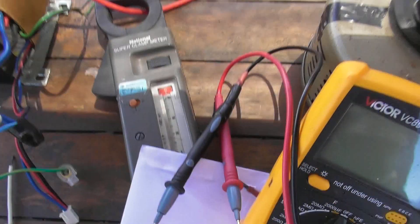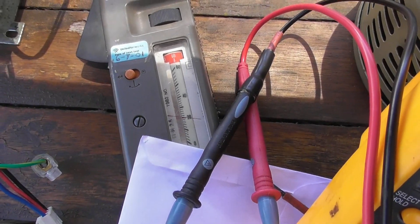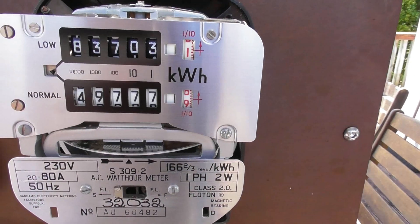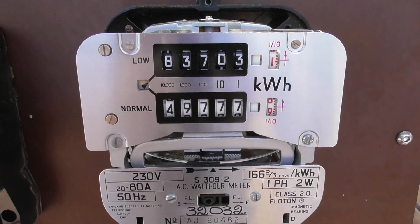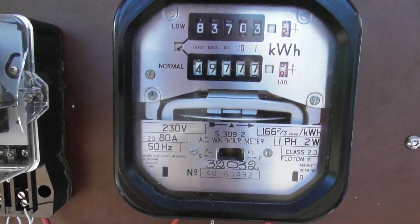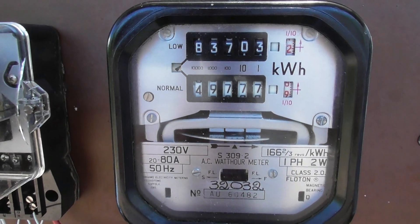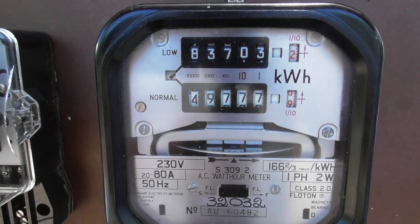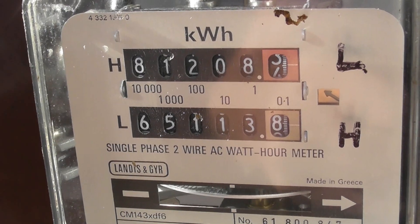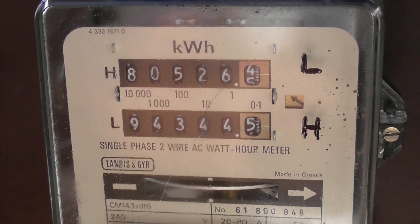That load is about 18 ampere, so I'll get it up a little bit more — so we've got 20, 25. I'll get a bit more speed on it. The reason the screw was taken out of this meter — it's got a low terminal but that's all right. I'm not planning to use this meter — I'll just keep it as a special for the collection. The low rate test is satisfactory on these meters, running fine.